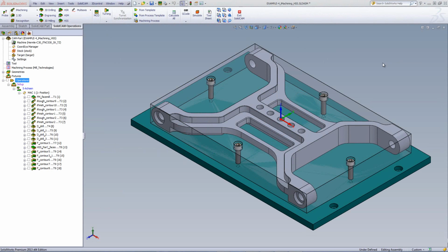In this recording, we'll demonstrate machining this part using mainly iMachining and also HSS to finish off specific areas which cannot be done in your typical 2.5D operations. In this part, as you see on the screen, it's mounted on a mounting plate on the machine itself, held by 4 screws. Other operations that we'll be using here as well will be drilling operations, and we'll also be using the chamfering option in our profile operation to complete the part.